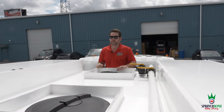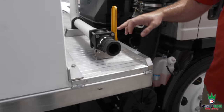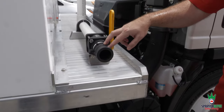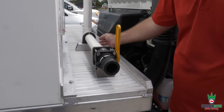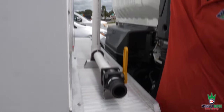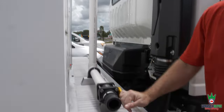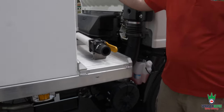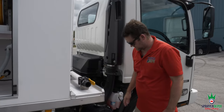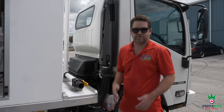When filling your tanks from the ground, you have a Banjo two-inch male cam fitting and two-inch ball valve with two-inch PVC, plus a Foster protection U-clip coming up over the top. Put your cam lever on, open your valve, and fill your tanks — you don't have to get up there every time. Getting up there can be a little dangerous, especially if you're not in great shape.